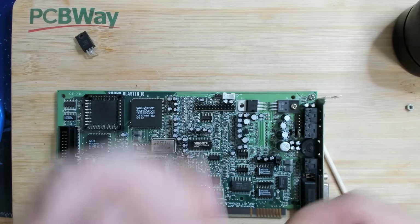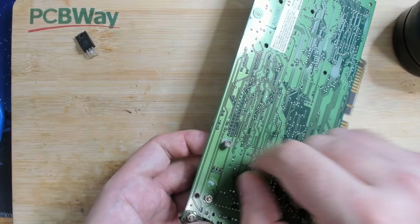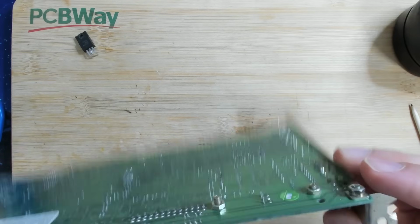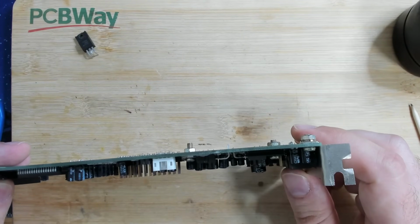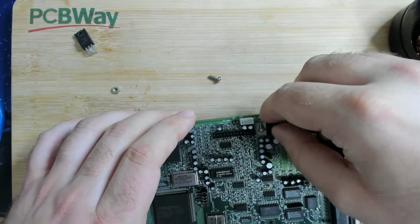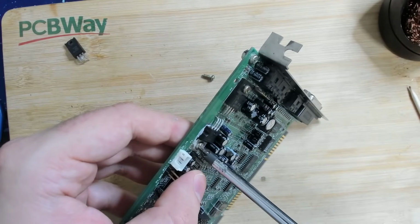There's a small screw that holds this entire thing in place. Never was that simple in any of my repairs. There was just a voltage regulator. Okay, so I see now that this voltage regulator is having a thinner tab compared to this one, so the screw is a lot further out, so maybe we can do something about this. But I think a better solution is just to use a shorter screw. So this one should work well enough. So this one should be long enough to come out on the other side, and yes, that looks not too bad. One final twist with a screwdriver.